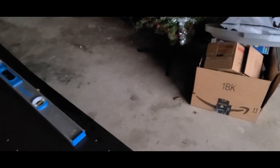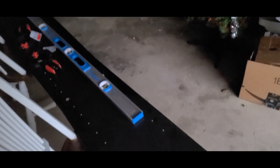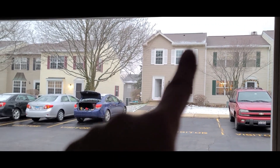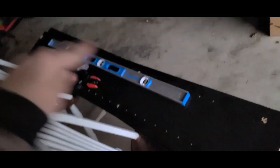It will give me about a quarter inch of wiggle room. So what I'm going to have to do is measure from the good side — this side — in eight and a half inches, and then rip this board all the way down the length of the board. That way I will have the board as wide as I need it for these tubes. I'm going to measure that out and rip these boards now while I still have a little bit of light. I brought my clamps so I can clamp one shelf on top of the other to get a nice, clean, straight line. I believe that window is exactly three feet, but I might need it a little bit wider on that smaller window.